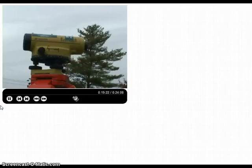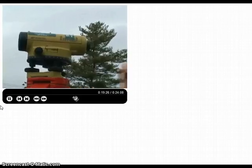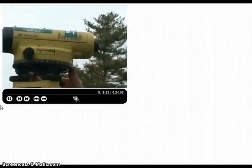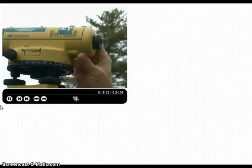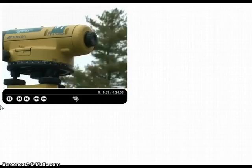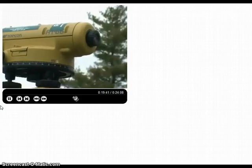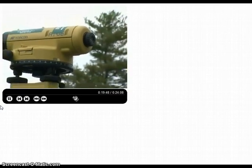instrumentation compass reading on the bottom to approximate an angle. I've got Lisa lined up, I've got the scope lined up, so I'm going to set this to 0. There's a mark on the side. I'm going to turn my scope to a stake I have planted in the ground. Yes, I've got it, and if you'll notice, I've turned approximately 40 degrees. This is not precise, it's only to the nearest degree. Well, we're all set. Let's go inside and do some calculations.